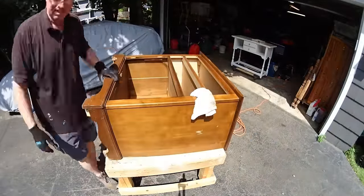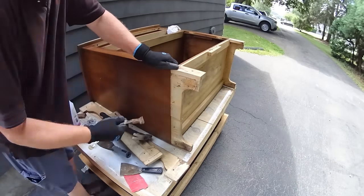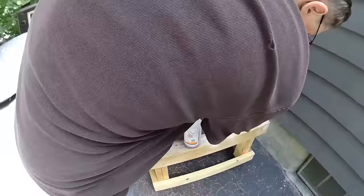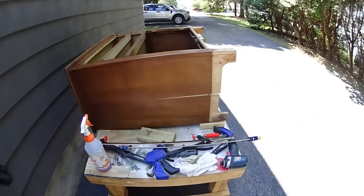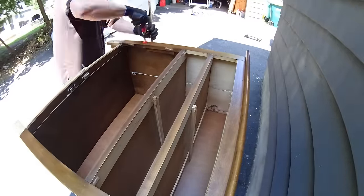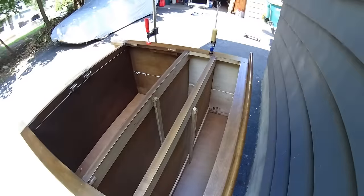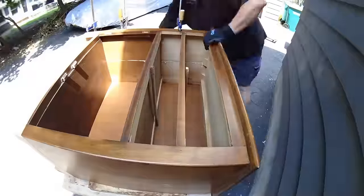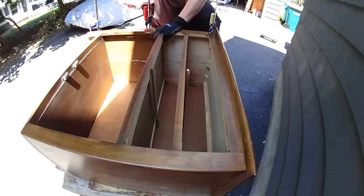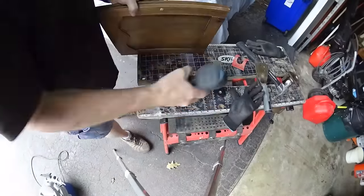So he figured out a way to build me a new base. Luckily I had some baseboard left over from projects in the house, and it turned out to be just a little bit off, so I had to rip the bottom off to make it the right height. So here I'm splitting the wood apart, pouring glue in the space, and then clamping it back together. And then I had to even it out — the boards were semi-warped, so I couldn't get it perfect. Without knowing how to disassemble an entire piece, I couldn't get it any better than I got.